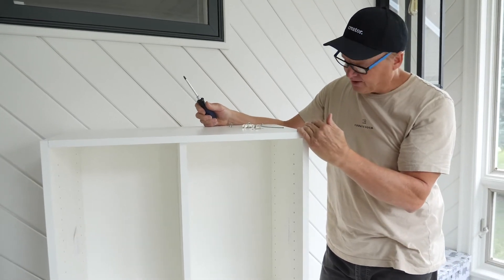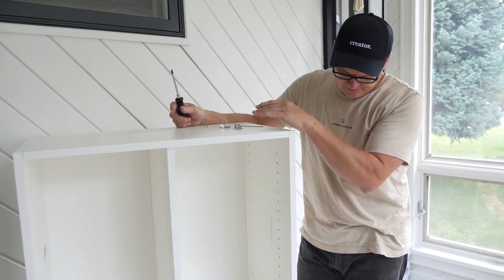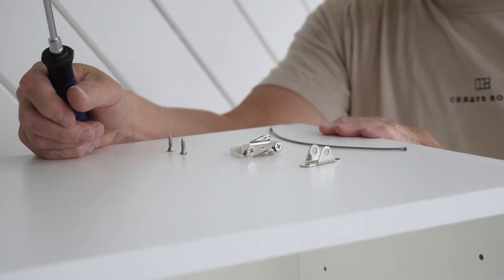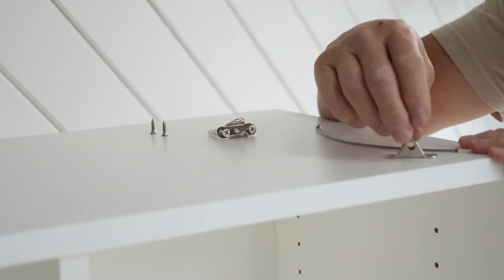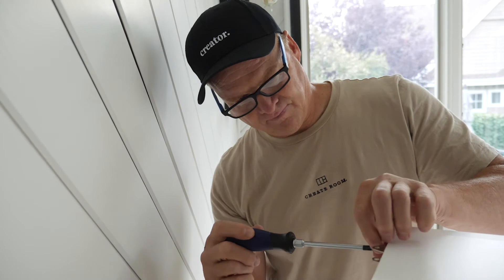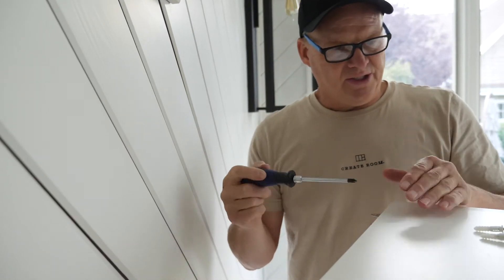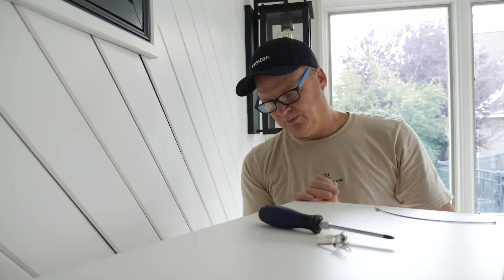Like all furniture pieces over four feet high, we strongly recommend that you attach this to your wall so there are no tip-overs or accidents. We've provided you with two anchors to help secure the top box to your wall. There's a little metal loop, an attachment point where you screw into the box — I can show you on the back where that goes. When it comes to attaching it to the wall, you're going to need a quarter inch drill bit, depending on whether your wall is sheetrock or metal.